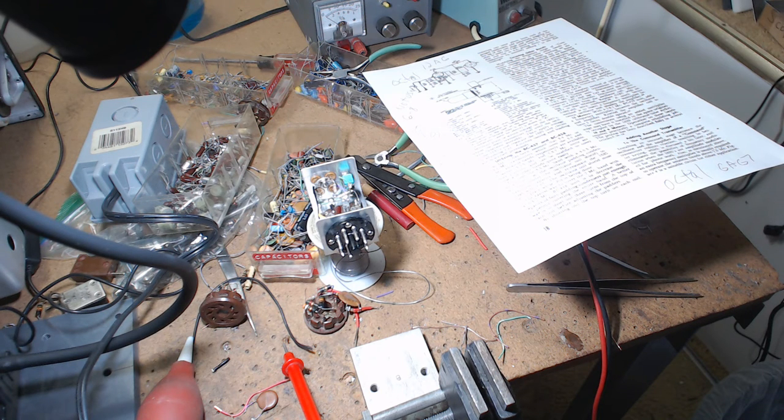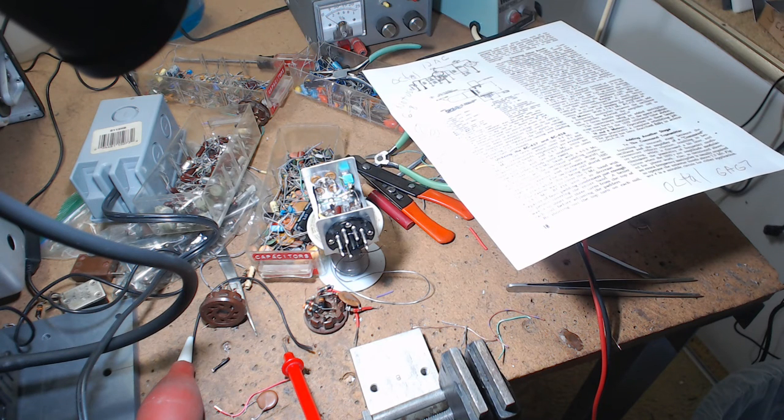What was wrong was the guy at the parts store gave me an 8-ohm earphone but the circuit called for a 2000-ohm earphone, because it was basically a transistor circuit operating as a high-impedance tube circuit. I was really disappointed — I'd spent hours going over the wiring and nothing was wrong — but I did not understand impedance. An earphone isn't just an earphone.